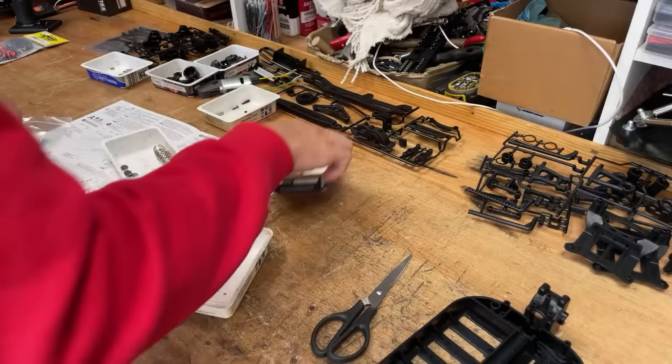And then we've got the steering system, which consists of the orbital valve, which is the valve that attaches to the steering column. So you've got the steering wheel up in there, the orbital valve, and then the lines coming off. A couple of the lines go back to the pump, and then you've got a couple of lines that go down to the steering rams. So with the new system, I've got to get all the hosing remade to thicker lines because they flow more pressure, more consistency, all that stuff.